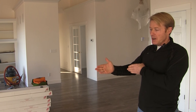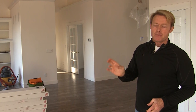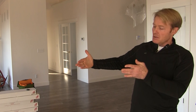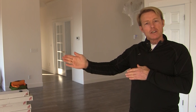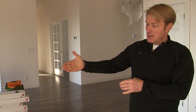Do the next row with another set of blades, leaving the first row's blades in. The reason you leave the first row's blades in — even though it's nailed — is there's enough movement that driving the second row could push the first row back tight and you lose the gain you're trying to make. Do that for two or three rows, then check your measurement. If you're back on, stop; if you need a little more, keep going. You can also use thin custom steel shims from a fab shop to avoid dealing with sharp razor edges. It's a subtle way to bring alignment back without it being perceptible from standing height.